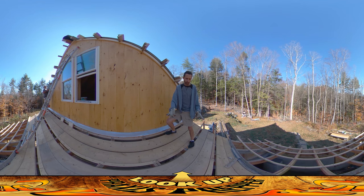They're at least up and I can get foam on the outside. As I mentioned in an earlier video, before we put the actual roof down I really want to get the foam and the siding up because it'd be a lot easier to do that before this roof. Additionally, there are going to be boards between all these little purlins — the purlins are the boards that run perpendicular to these rafters — so that bugs can't get up and so we have some support under the polycarbonate roofing panel for screwing into. I've got all of those prepped, measured, cut, and ripped down to the right size.